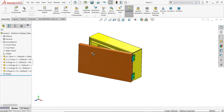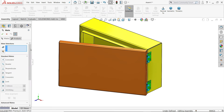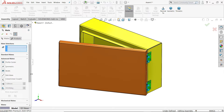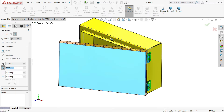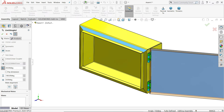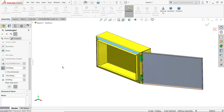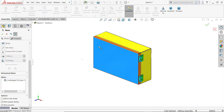Let's add one more important relation. This is moving like this, so activate Mate tool, go to Advanced Mate, and we will define an angle limit. Choose this face and this face. Set maximum angle to 180 degrees and minimum to 0. Say OK. Now let me rotate — see, 180 degrees to 0 degrees.